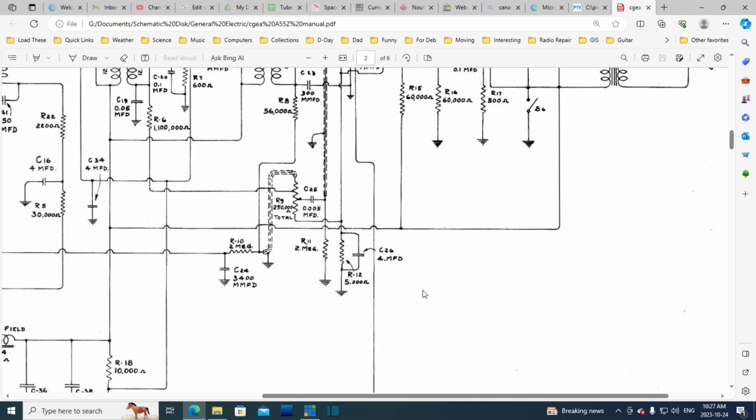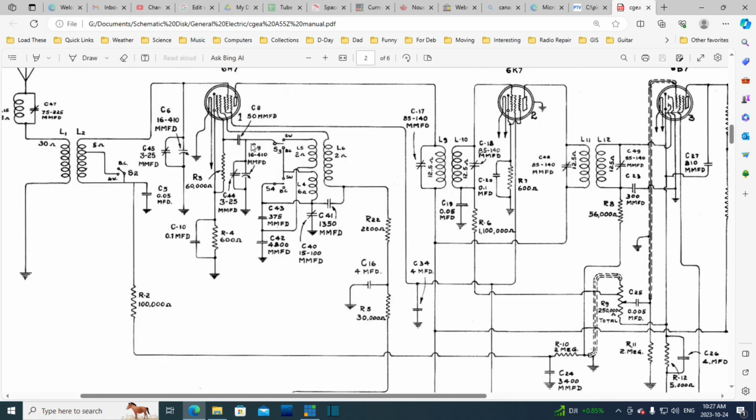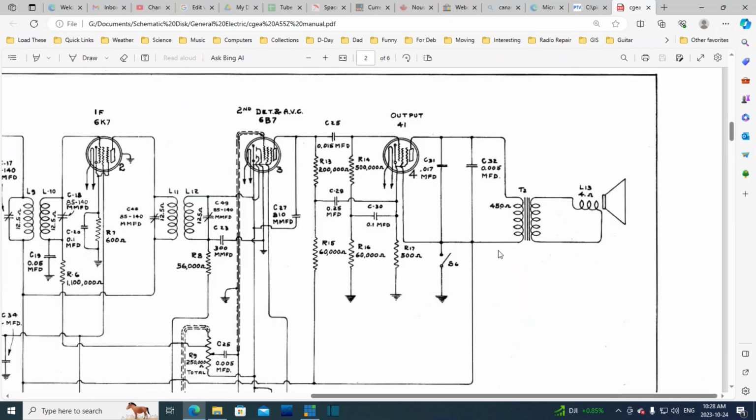This tube, and generally the rectifier tube, the number 80 down here. These two tubes are usually, in these radios, working hard. They're running hot. They're often physically larger than the other tubes because they run hot. They need to run hot to convey the current. And the result is, to make one of these tubes serviceable for the same length of time as, let's say, this one or this one, this tube would have to be hefted up to the point where nobody would sell it. People would buy the cheaper rectifier tube, and so these guys tend to wear out. I want to say prematurely, but wear out during the life of the radio and need replacement.